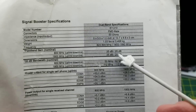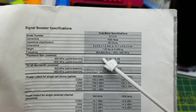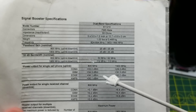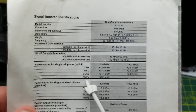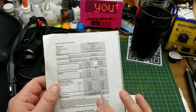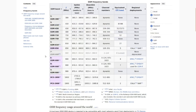This unit claims to have 25 dB of amplification on the 800 MHz and 1900 MHz cellular bands — only those two bands, which isn't a big deal. They're still in use; they're the oldest ones and probably the most congested, but they definitely exist. This thing claims to work with CDMA, GSM, EDGE, and AMPS — the old analog system that doesn't exist anymore. There's no reason it couldn't work with more modern technologies either, because this is just a raw RF amplifier — it's not doing any decoding — and those channels are still in use today.